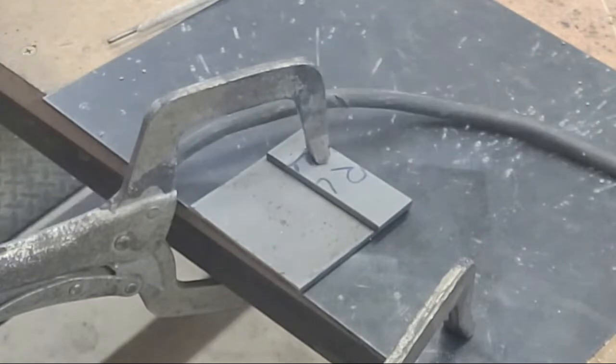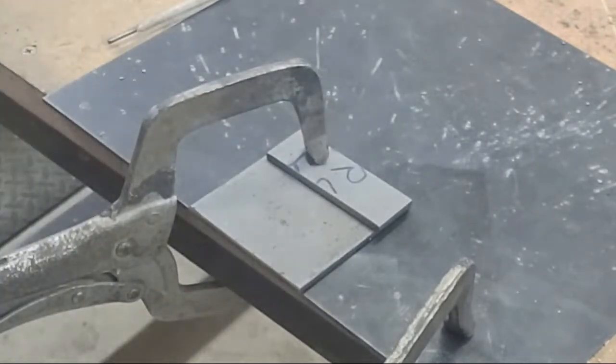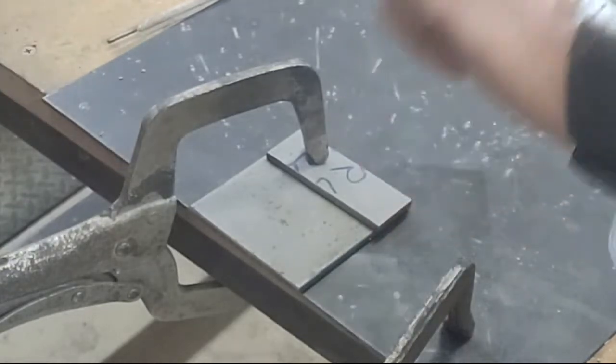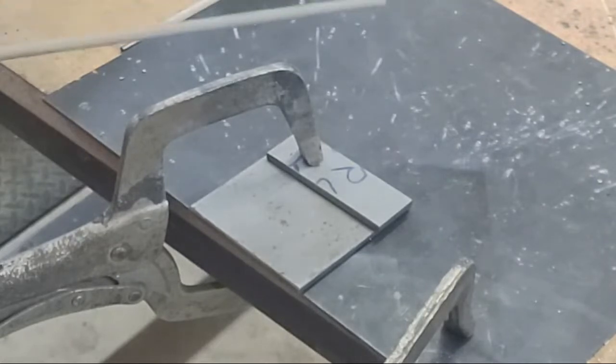What I've got right here is that 6011 rod, and I'm just going to run a lap joint right here. This welder is strictly AC. My wire welder is AC-DC, and so is that one set up for aluminum. That's another thing: when you weld aluminum, you need to be on AC. Since this welder is on AC, it will put less heat because of the alternating current — it's better on thinner material, though it doesn't make near as pretty of a weld as DC.